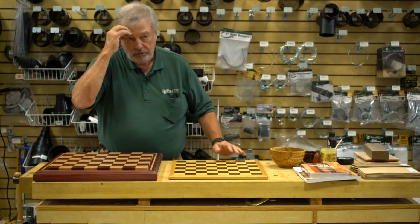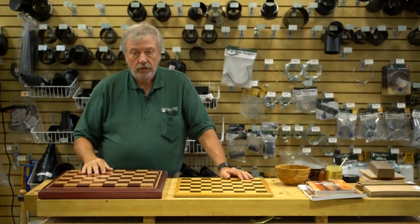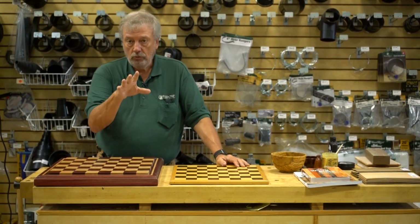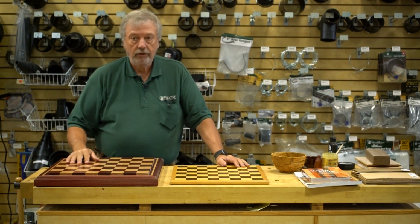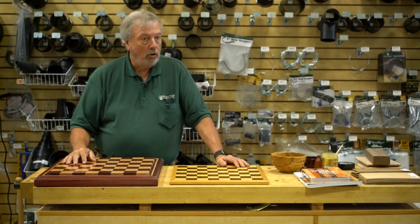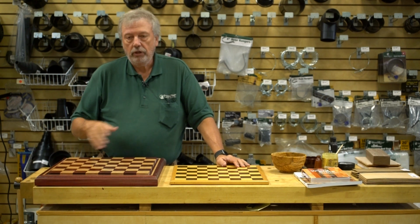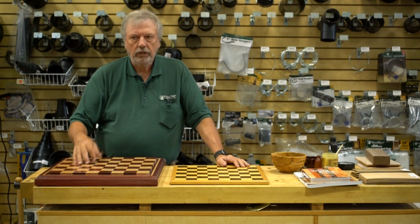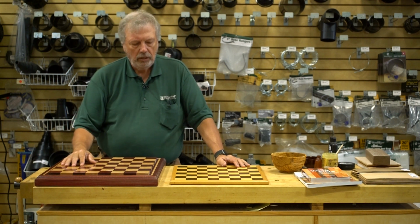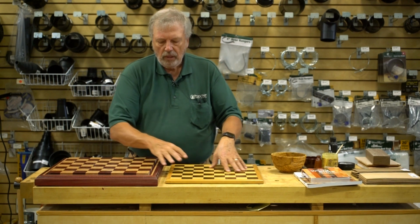So if you're going out to look at wood, and it's been sanded, surfaced, so that it's very easy, take a little spray bottle of water with you. You can spray the wood and you will instantly see what it will look like if you put a finish on it. And then the water goes away. Even better than water is alcohol. You can spray a little alcohol. Any type, please don't use good whiskey, but any type of rubbing alcohol is good because it'll evaporate right away. But it will show you what the wood is going to look like. But for everyday stuff, this is all we basically need.